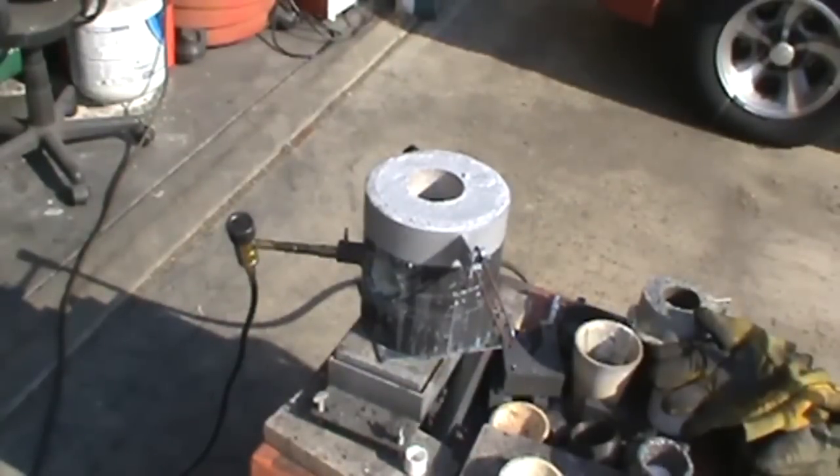Well, it's the dawn of a new day — a rare Sunday where I didn't have anything to do as far as eBay goes. I went ahead and fired up the torch, burned out the two opposing inlet ports, and cut in the convergent. Made the torch holders, got the torches in, relined it, and right now I'm in the process of curing it on idle fire.